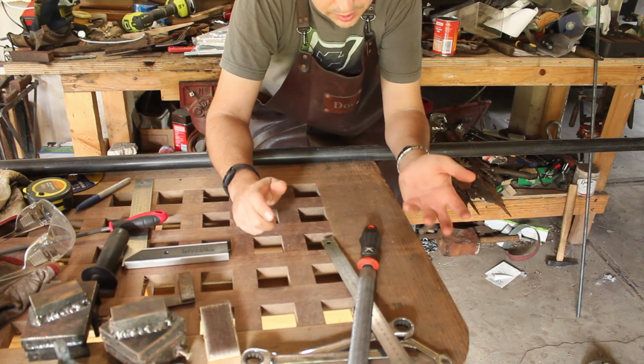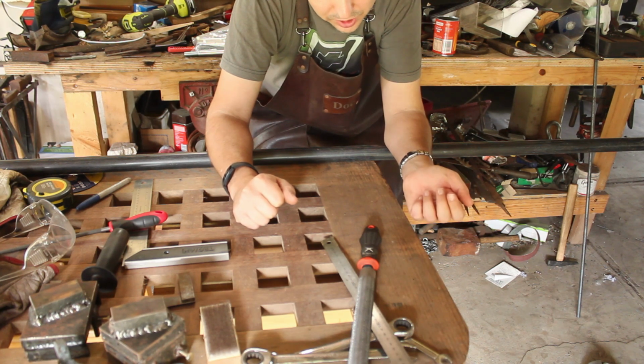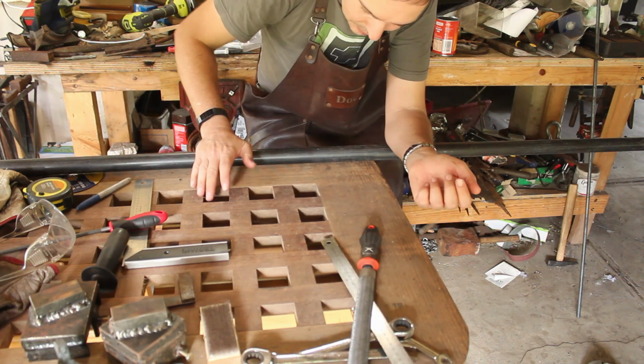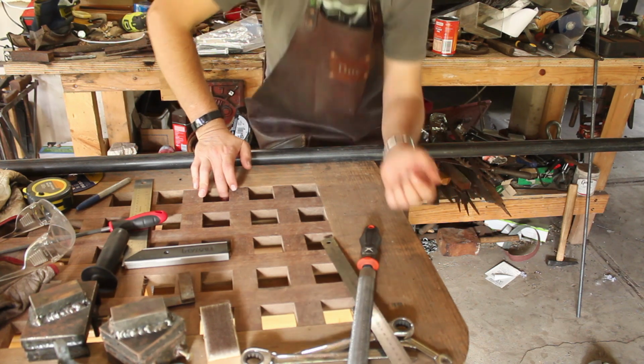And the beauty of this height is when you flip it on its edge, you have your fullers or your swages at the edge of it at about the height of the anvil. It's a bit lower, but it should be okay. So that means the legs are going to have to be 350 long. So let's cut 4 of those.